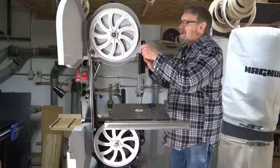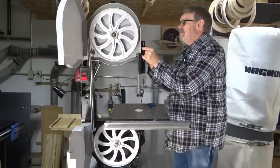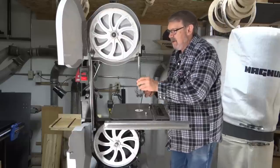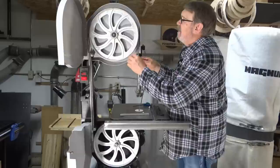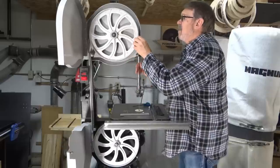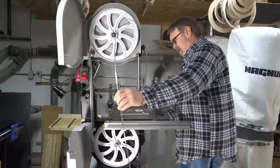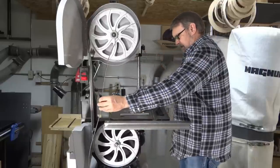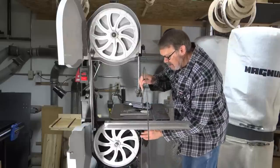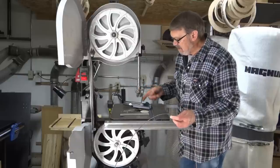The first thing I have to do is take the blade off. To do that, I first need to remove these guards. I need a 4mm hex wrench for these bolts. Now the tension lever is off so I can slowly work this off here and just pull this around. Need to take that insert out. I'll set this aside, then I'm going to start taking these blocks, these assemblies off.